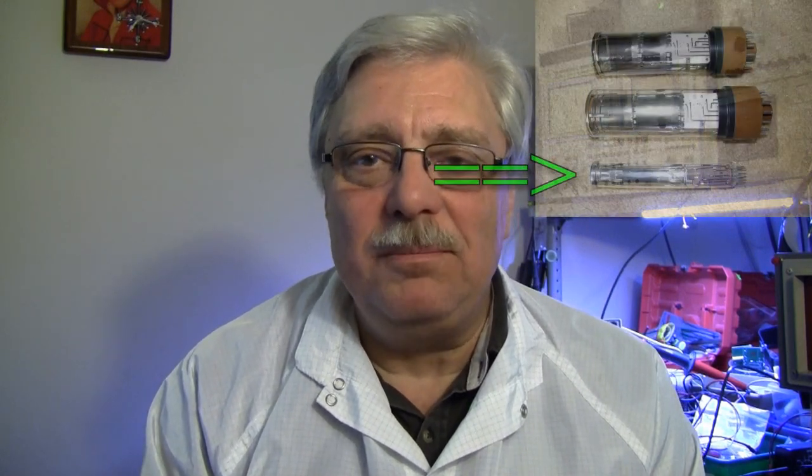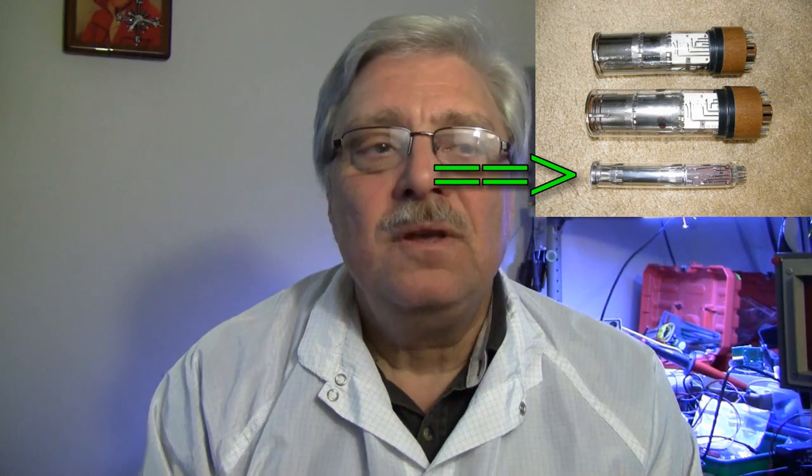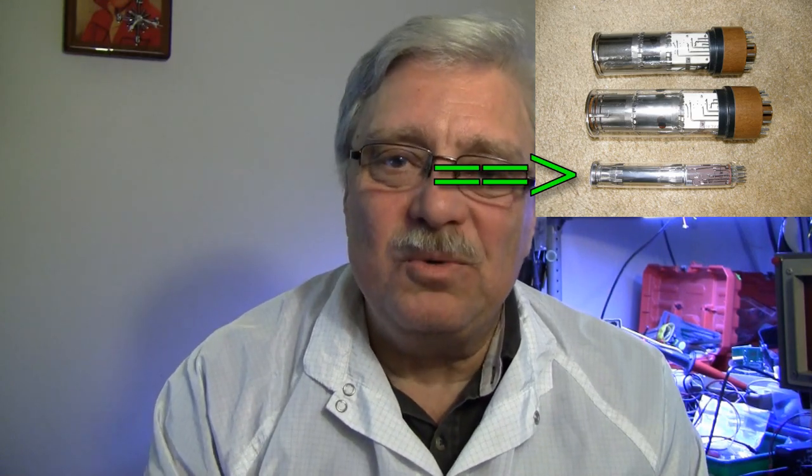Ironically, or miraculously, if you will, the deflection yoke that I got to use with the image dissector tube I'm using, called a vidissector, which was a special dissector tube that was made to use a standard Vidicon deflection yoke. The deflection yoke I have came from a Model 80 slow scan TV camera. So we know it will run at these scan rates.